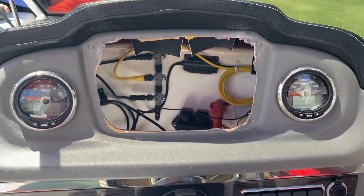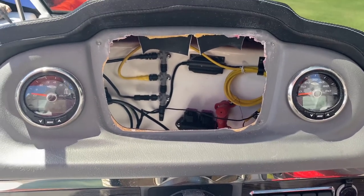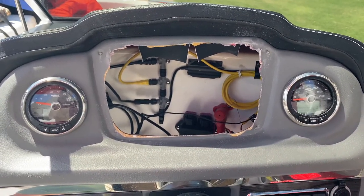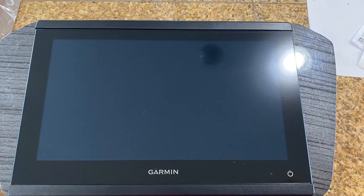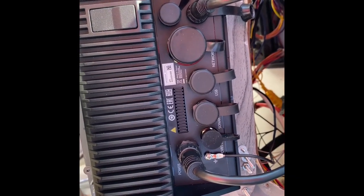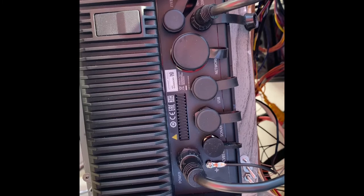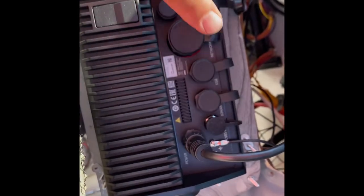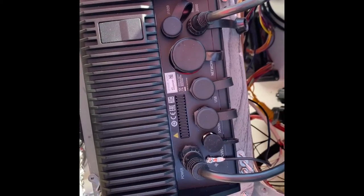Okay, so we're back out here. We got the Garmin panel trimmed and the Garmin unit attached to the panel. I came out to test fit it - we did a little bit of trimming. On this one I had to trim a little bit of the top two corners, not much, just a little bit. So it's all fit now and I'm going to go ahead and get the Garmin back installed. So we have the NMEA 0183 connections made for the talk-out: the TX out on the antenna to the RX on the unit. We also have the unit grounded to the common, which is this wire here. We have the power-in cable with the NMEA 0183, and right here is my NMEA 2000 plug-in. We'll go ahead and put it back in and install it.